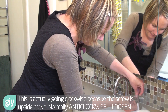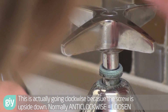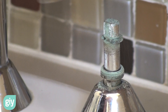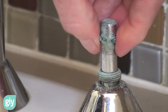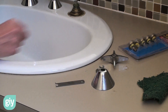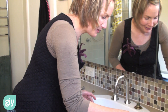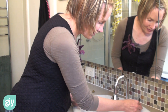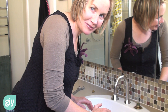Just keep on loosening it out and it will come off. Then the tap head just comes off — there's a little piece in there, take that off and keep everything in a nice spot to the side. Then remove the bonnet to reveal the grime and the workings of the tap. This is called the spindle, and under there is where we'll need to replace the washer.